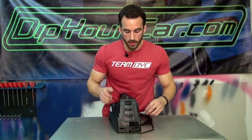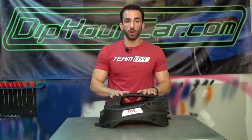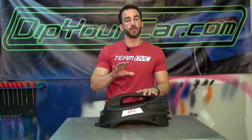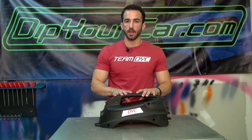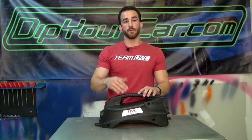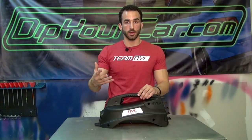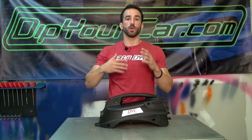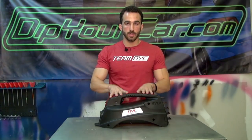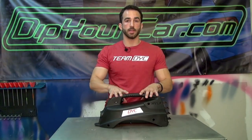What's different about this turbine compared to the 3500? Not only is it smaller and more efficient, it's actually quite a bit more powerful. The 3500 system puts out about 2 PSI. This system puts out about 3 PSI in hose — that's about a 50% increase in power, and the CFM is increased as well. The increased PSI and CFM result in better atomization, meaning a finer misting and smaller droplets of Plasti Dip coming out of the front of the gun, which translates into a better, smoother finish.